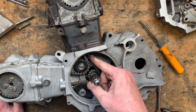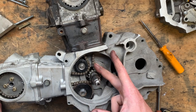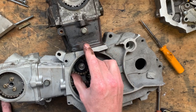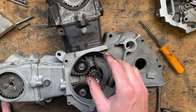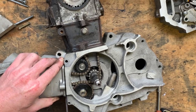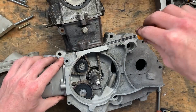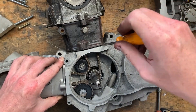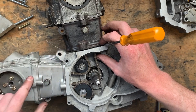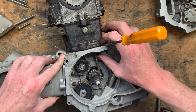What I'm going to need to do is tension it up over a greater radius and make a little tensioner doohickey, probably out of nylon or something. It is going to have a little bit of space — about three mils for the two head gaskets and two base gaskets — so this should put a bit more tension on the chain, making less of a job for the tensioner. I do want as much engagement around the crankshaft sprocket as possible just to avoid any slipping.